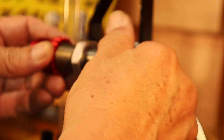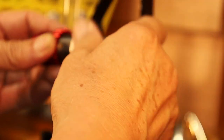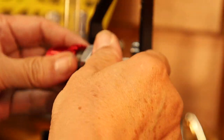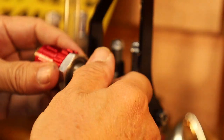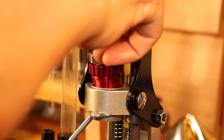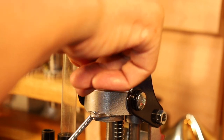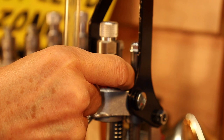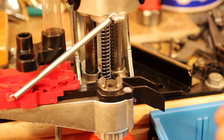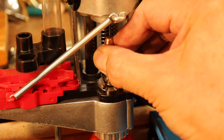Just like that, we're ready for powder charging and bullet seating. We go ahead and put the bullet seating die back in. For this, we can use the taller breech lock. We want to have the little split ring right there toward the front. Bullet seating is very nominal on the Lee App Press.